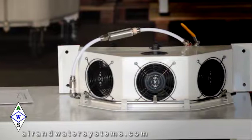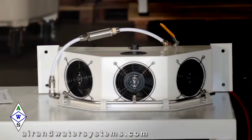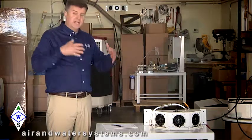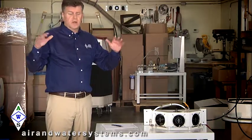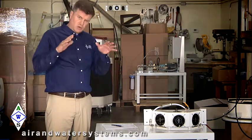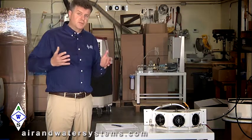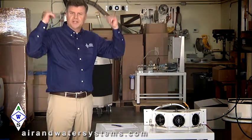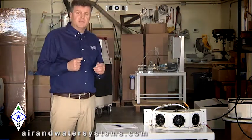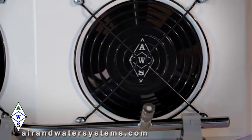Applications where this would be used would be in a lot of different digital lab type applications or digital prepress, where you've got a lot of area that you need to cover. Digital photography areas where you want to control that static humidity. Some of your larger press areas, some of your larger commercial type applications where you've got a low ceiling height. And so that's perfect for that, because even with air conditioning, we can overcome that with the amount of nozzles we can put into play.